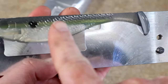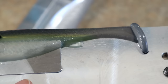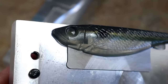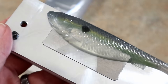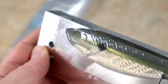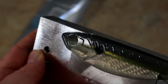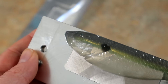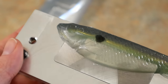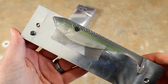Look at how that gold highlight vein pops — you can still see the chartreuse. Beautiful. And most importantly, no cold cracks. We have a very nice, straight, even laminate — the vein just kind of fades into that tail section, and that is all thermal blending. No cold cracks anywhere. Even looking under glare at the section where all the colors meet — no fissures, no cracks in the surface. Exactly how we want this bait to come out.